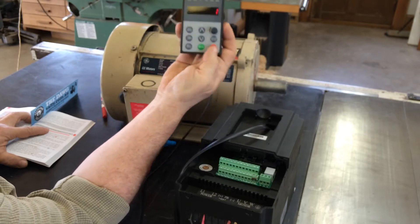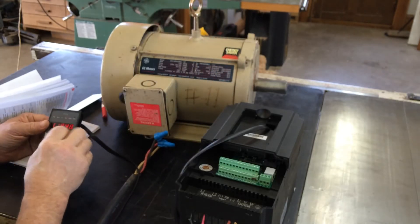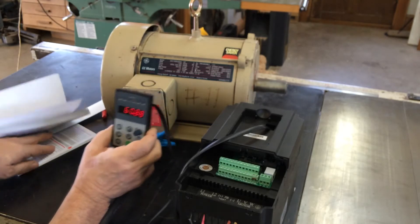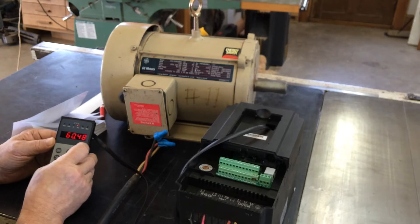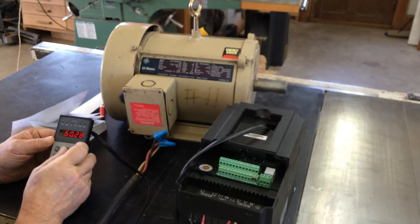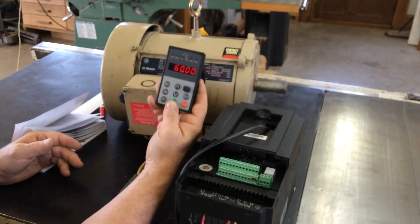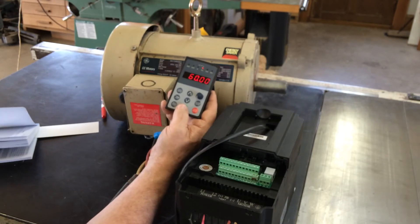Function one will run an automatic test. We're going to enter that. We're now outside of that — we can now escape. We'll set this to 60, because it's going to run a test and send current through the windings. All we'll do for that is press start. Let's get that exactly to 60. Now we're going to run our test. The motor actually won't spin — you can hear current running through the windings as it syncs.